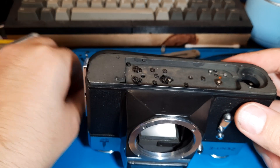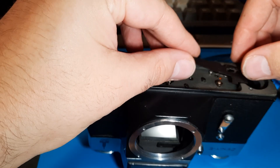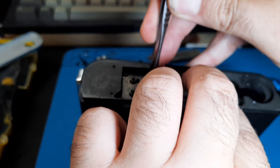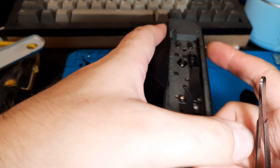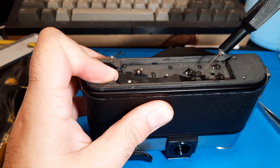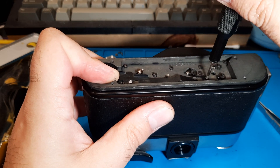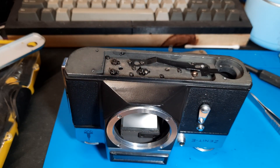That's working because it's going up and down. See what I mean about these being very simple cameras and thus very easy to work on. Try and get that to sit in an up position but it will often fall back down. Then you use your tweezers to lift these up so the screws are up, and then just push it in as far as it can go. Hold that in so it doesn't slide over. I made a mistake — I didn't put this in first and it instantly rolled on the floor. Gravity instantly punishes me for forgetting a part.